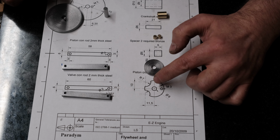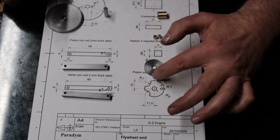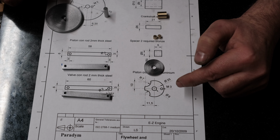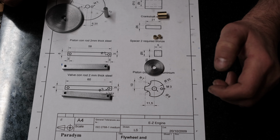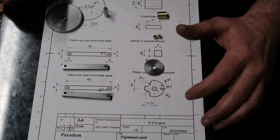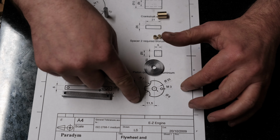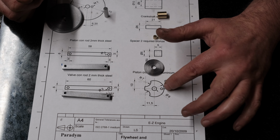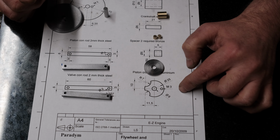So I don't actually have a 14mm drill to do a 7mm radius circle on there. I actually only have a 13mm drill. So that's what I'm going to use. It's going to be slightly smaller than that radius, a 6.5 radius instead of a 7. But that's absolutely fine. That should work because that's the only tools I have available. I just need to be careful of the offset, where to drill these. And also in the same setup, I'll also do a 2.5mm hole for the M3 thread on that edge.